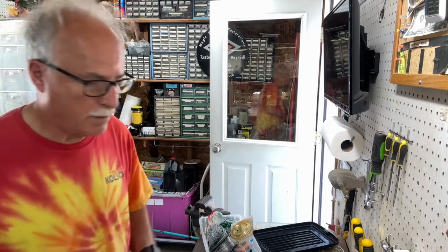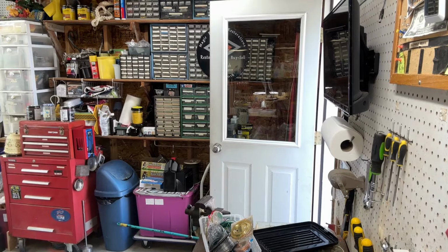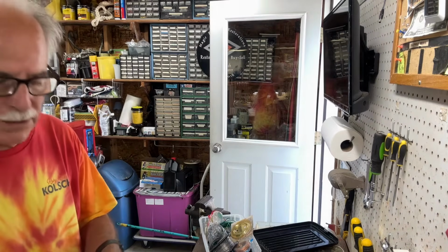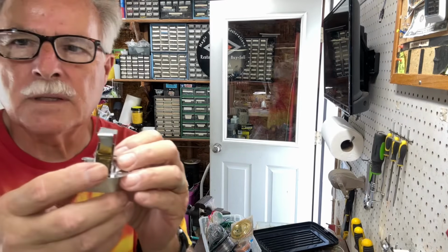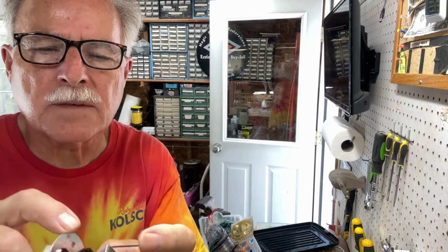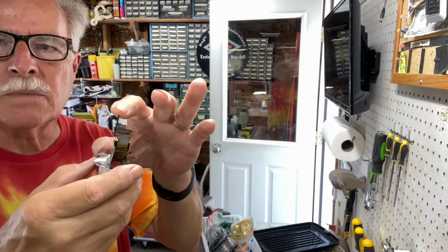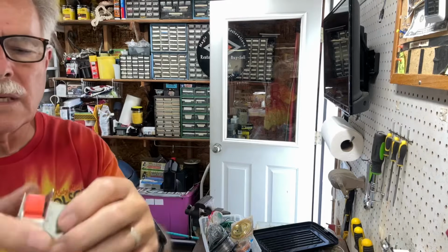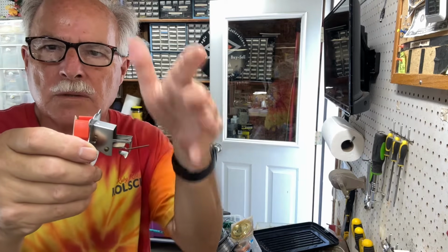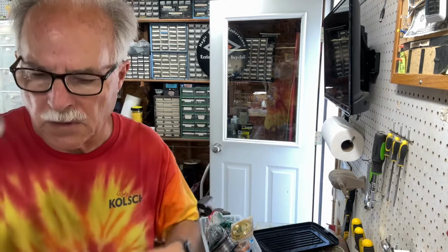But if you're familiar with a power flash tulip, the power flash tulips all have this little wire soldered right up in here. Well, you can't see it for that. Okay, it's right in there. That's a solder joint right there at the end of my finger. So it's a little angular bent piece of wire. So when the tulip sits in the machine like this, and those actuators move up and down with the solenoids, it opens and closes these tulips. Okay, that's how a power flash works.